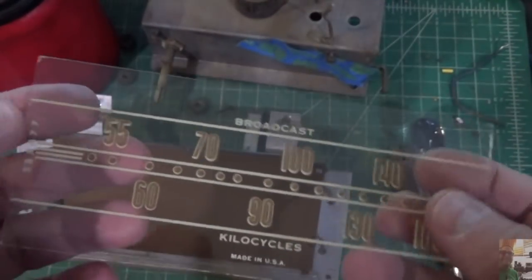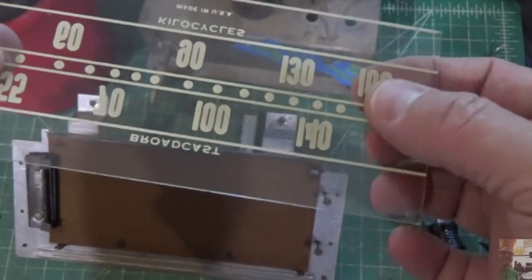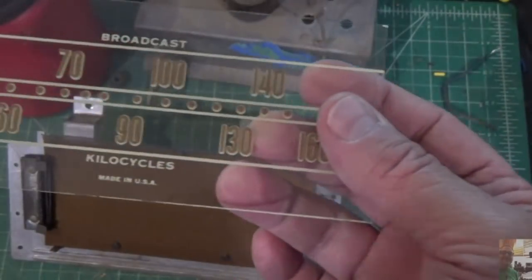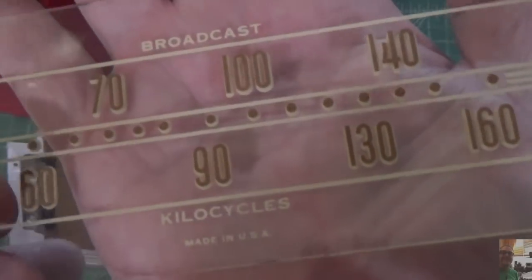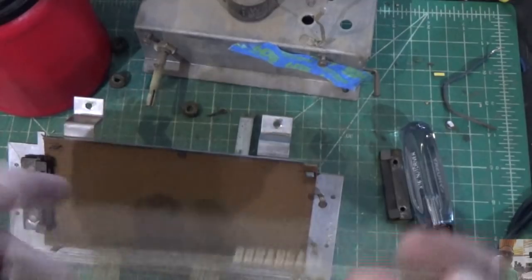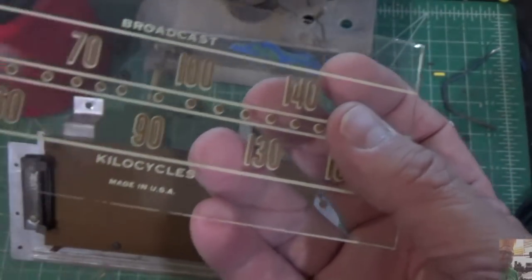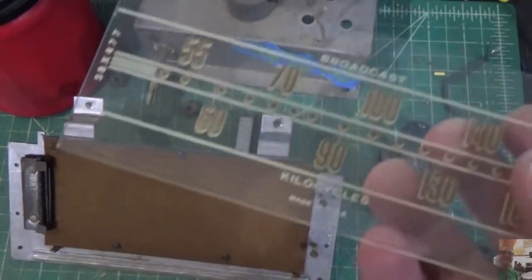Just as an update — I've cleaned this glass. Remember a few things about dial glass: one, it can be very sharp so be careful; two, the silk screen is on both sides on this one, so don't spray Windex or anything like that because you don't know if the paint will flake. What I did was simply run it under water to get the surface dirt off, then used 90% rubbing alcohol with a soft brush and wiped it off with a soft cloth — it's pretty much crystal clear now. This particular one looks like it's silk-screened white on the bottom and gold on top.